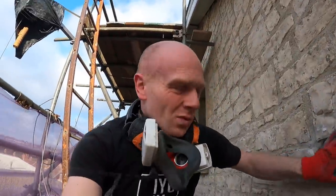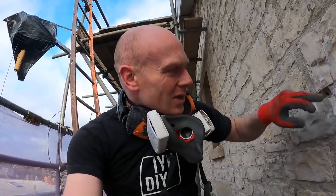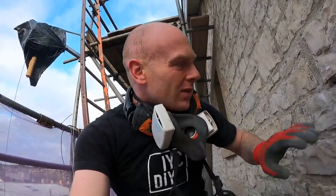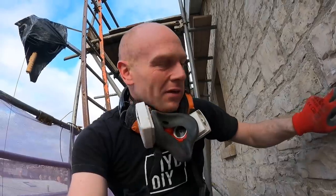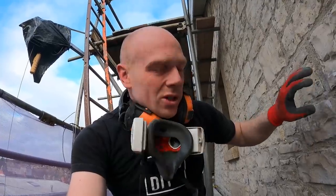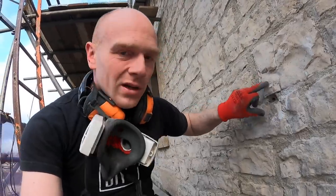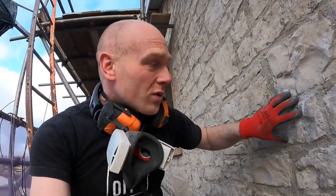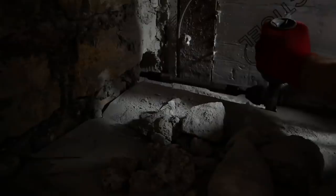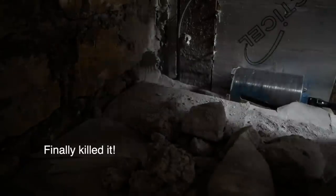With all good intentions, that's not going to work. Our pilot hole came through right on the mortar gap so it's actually just widening and not staying central. I think we'll have to just go from the inside really steady. When we get near the outside I might just come around — I can see we're still a little way off — and then just chip out the last little bit. Because we've got an elbow coming out here we'll have to enlarge the hole for the first 40mm or so to accept the socket size, so it's going to be a bit wider. We're going to need a new drill.